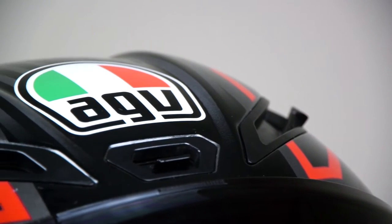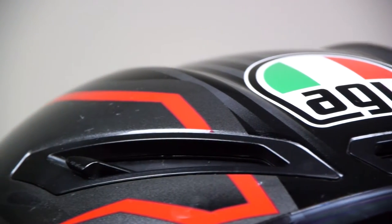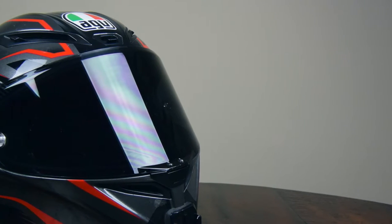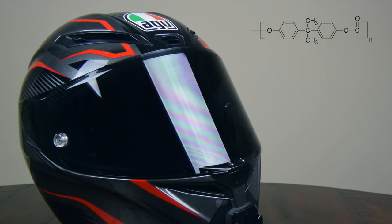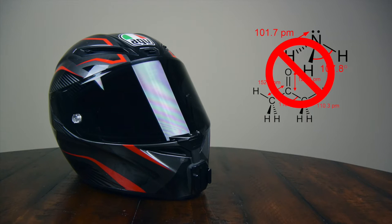Let's touch quickly on the things we want to avoid. To do that, we need to understand what the helmet is made of and see if those substances are compatible with any cleaning chemicals we're about to use. For example, most face shields are made of polycarbonate because of its shatterproof characteristic. So if polycarbonate dissolves in the presence of ammonia or acetone, it doesn't take a chemist to realize you shouldn't combine those.